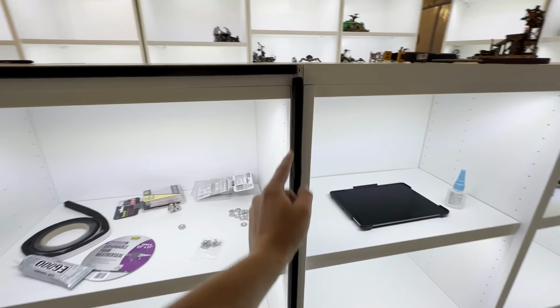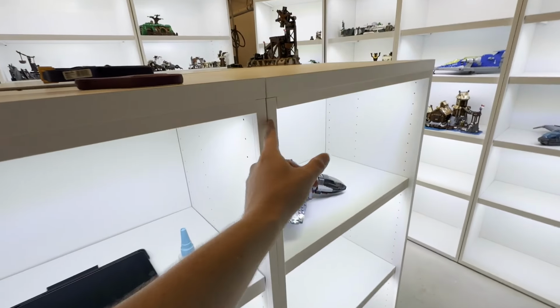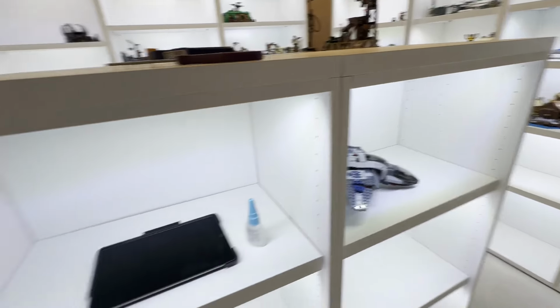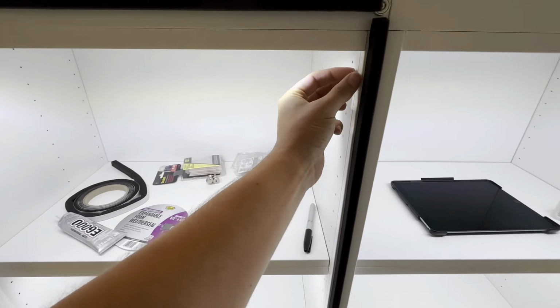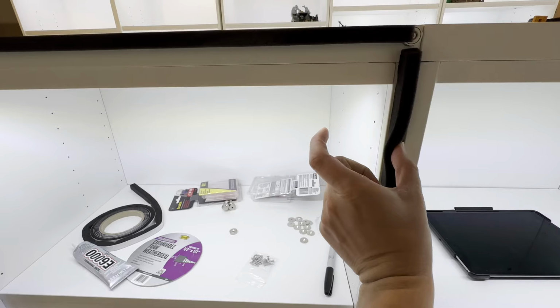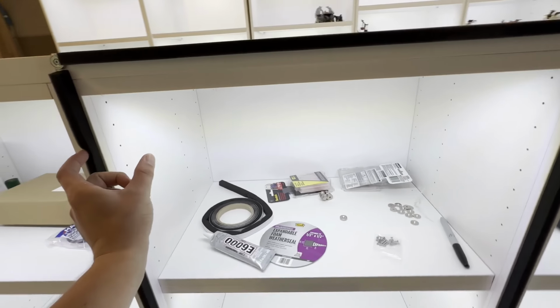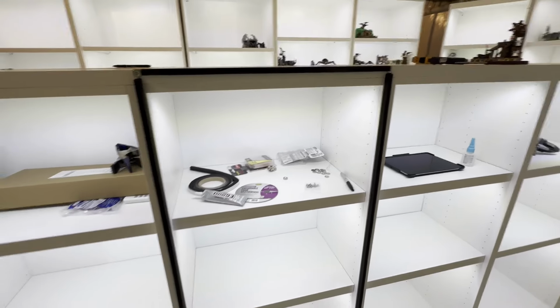And you open it up, you got your little hinge sitting on the outside. When you got cases butted up against each other like this, you can't have a hinge here without having the other case hit it. So you can use a cabinet door frame. However, then you need something to attach it to, probably out to here. So then I'd have this big piece of wood coming off here about 3 inches, which was kind of what I was trying to avoid with the whole frameless thing in the first place.